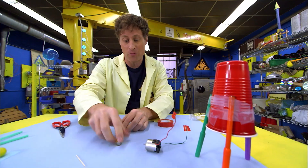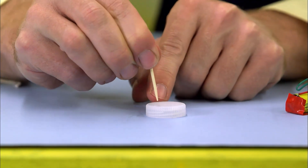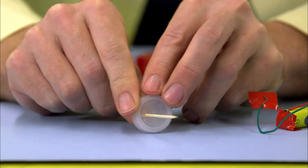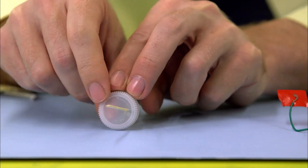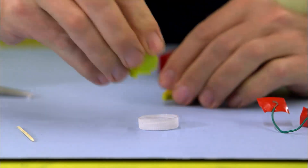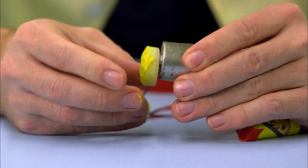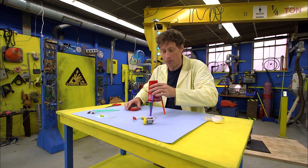Next, take your plastic drink bottle cap and make a hole with a toothpick. You want to make it off to the side — right about there. That's so when it turns, it will be off-center. That's what's going to give us our vibration. Once you've made that hole, take some modeling clay and stick it in the cap to give it some weight. Then stick it onto the shaft of your motor. See how it's off-center there. Now we just need to attach it to the vibrobot.